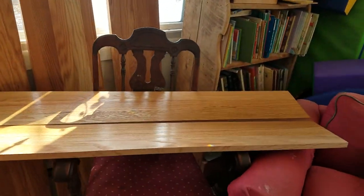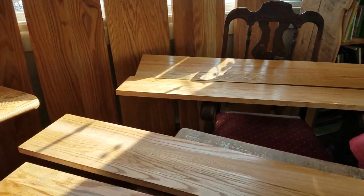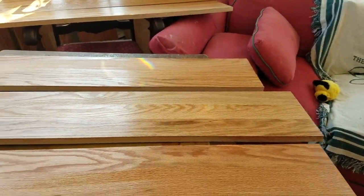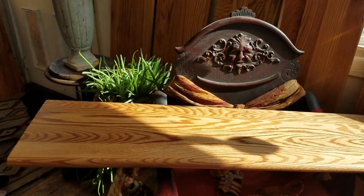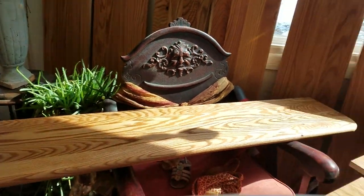It's not just that it takes 24 hours between coats — it does take eight to ten days to cure. So if you're doing a floor, it could take some time. These boards will be here for eight to ten days before we actually put them into our stairwell. Thanks for joining me today, and hopefully you will tung oil your wood too.